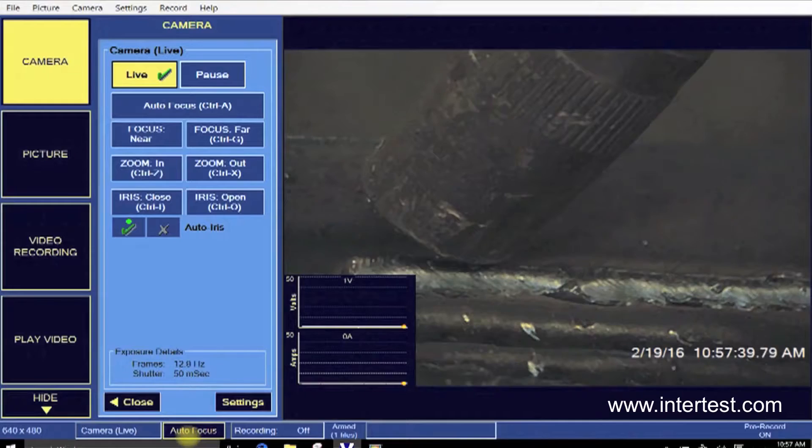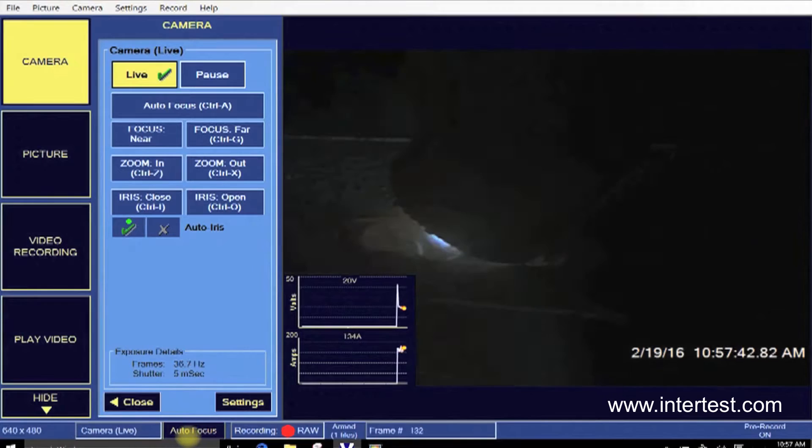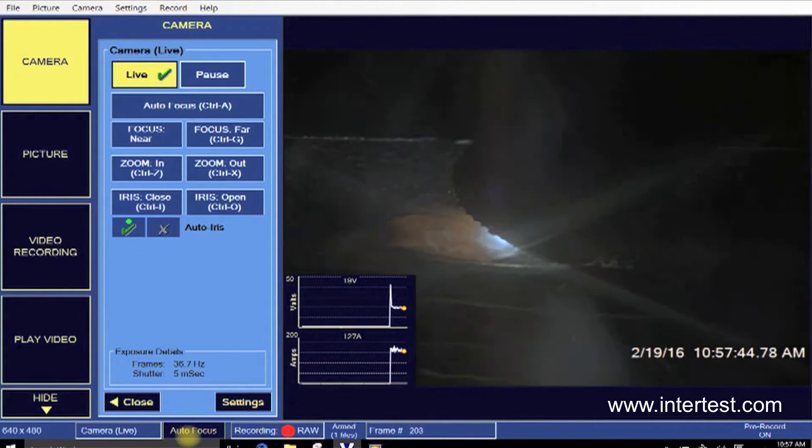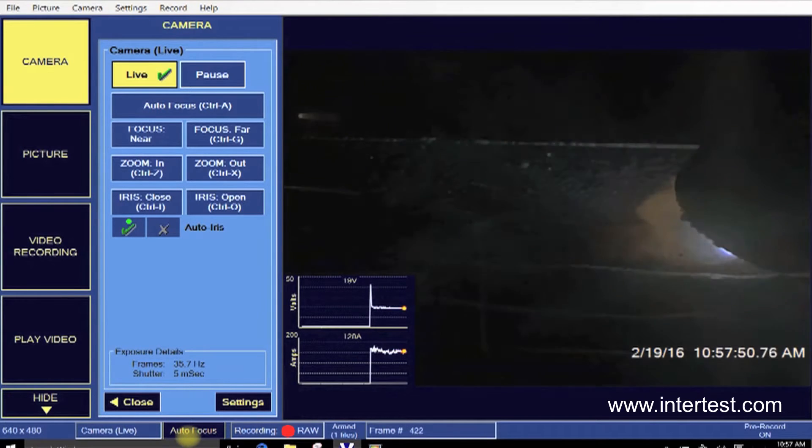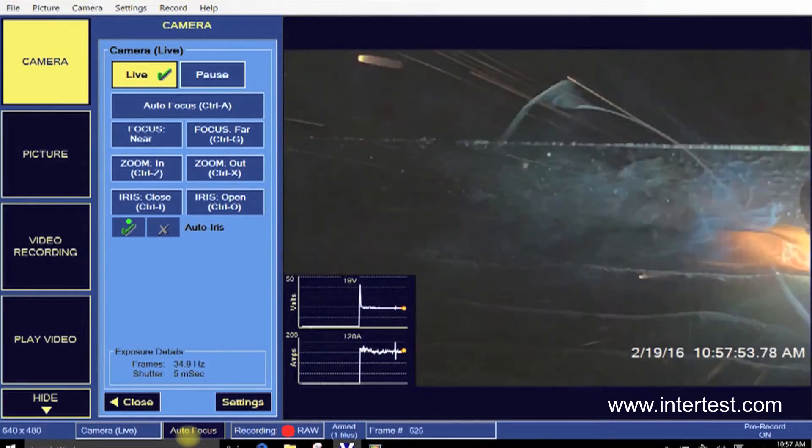As they were welding they saw the position they were holding, the turning of the nozzle, how the nozzle should be straight, and the distance they should hold for the wire out of the welding. In time they did learn to pick it up and did better by watching the machine. Looking at the amperage you can tell how arc length is holding — whether using a whip, stick rod, MIG gun, or TIG torch. It works for all the processes.